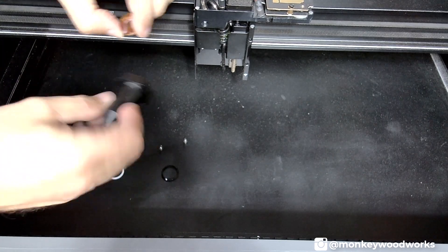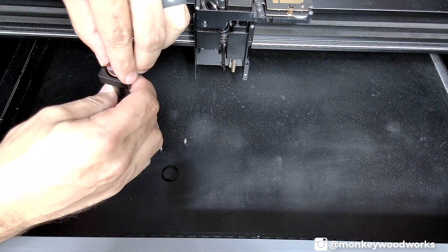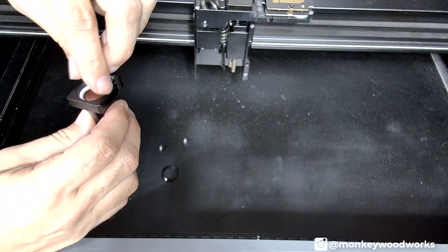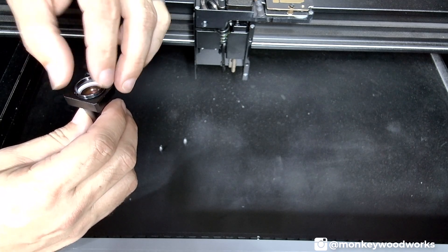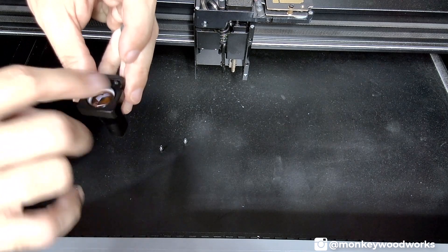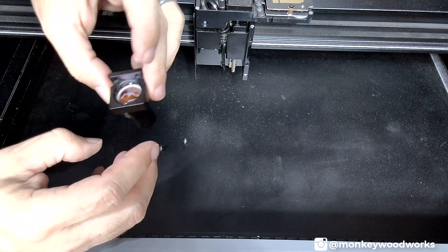I have everything clean now — the nozzle and the lens. I'm going to drop the lens back in there, carefully holding it from the side so you don't get fingerprints on the top or bottom. Drop it down, and if it doesn't sit flat, tap on it a little until it falls into place. Take your O-ring and put that in place. Then take your threaded holder and carefully start spinning it until the threads catch, making it finger tight so the rubber and lens will stay put. You don't have to make it super tight — just finger tight is good enough, as long as it's not shaking.